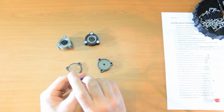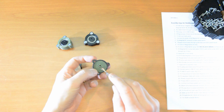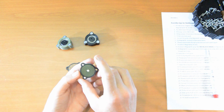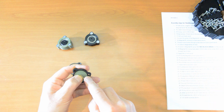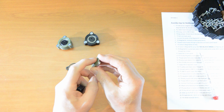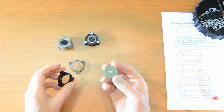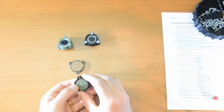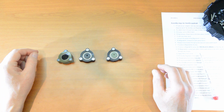Okay, so I've done a second one, and I was just about to assemble the third when I thought I would point something out to you. It's another point about the magnet. So I've got my red-blue magnet, I know where the north is, I'm going to press it in here. Now, that magnet has gone in very easily. Now, depending on how you print it, it might be a little bit tighter, there might be more friction, and if that is the case, make sure that you press it very firmly down. Basically, you don't want the magnet protruding below the base, digging into that cork. You'll just sort of damage the cork a bit, and it won't be as smooth in action. So just make sure it's firmly pressed in, and it should be pretty much flush. That one is absolutely perfect. In fact, it's slightly loose, I would say, but it doesn't matter. So there we go, 3 Maghall 6803F components.